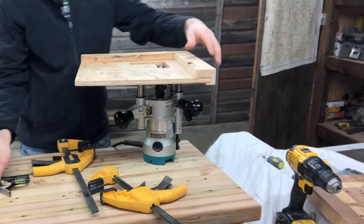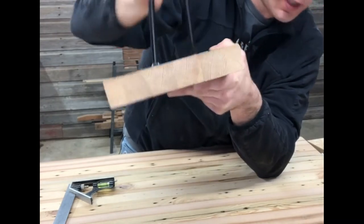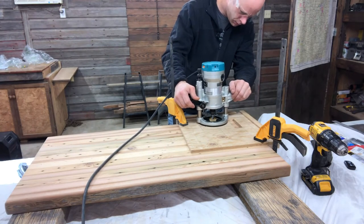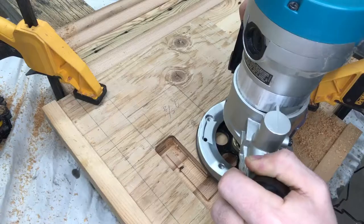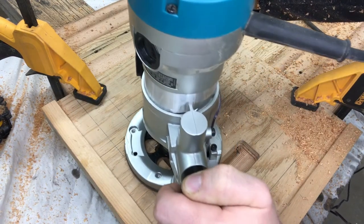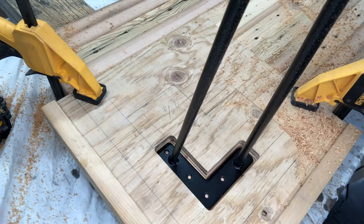For us, as long as we're getting close I'm pretty happy, because we're going to do a couple test cuts just off camera to make sure that we got that recessed just where we want it — nice and flush. Looks good. Attaching this jig is just two clamps and you're pretty much ready to go. We got our half-inch spiral bit in and we can start. This template just makes things so much easier and repeatable. We can clean out a table in probably five to seven minutes and get a perfect recess every time.